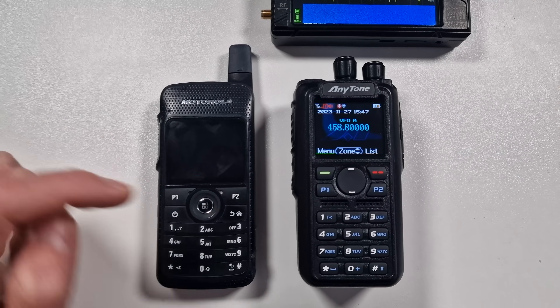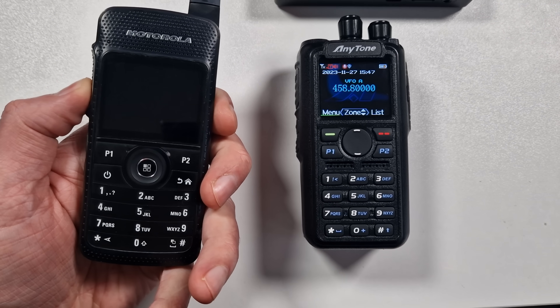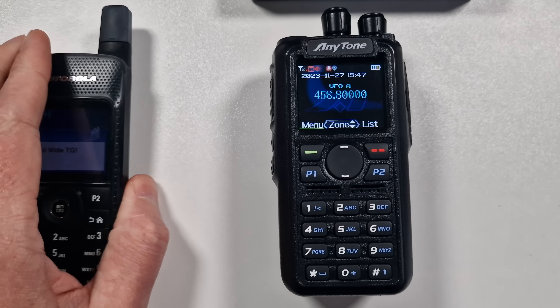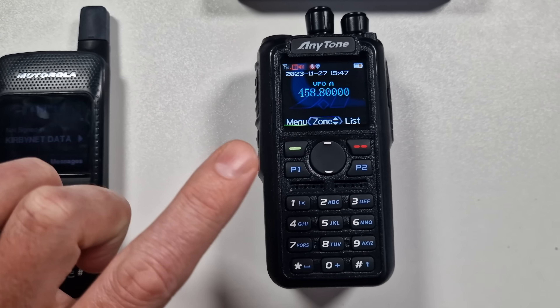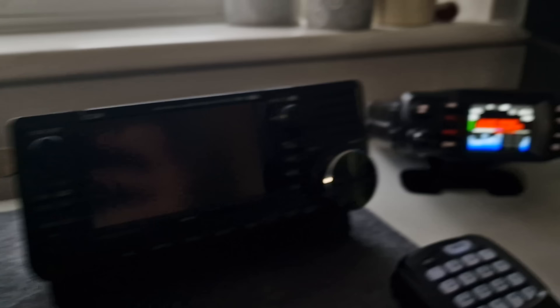You might not be able to listen to the digital one because they could have encryption enabled. Also, if you're using a normal DMR radio to listen to other DMR radios, you have to program a radio — you have to know some information about the setup. But if you have a DMR radio that can operate in promiscuous mode, then you can listen to all traffic on that channel. It will get decoded, but not if it's encrypted. A quick example: we've got an Anytone 878 UV2 acting in promiscuous mode on this channel, and it's just decoding the Motorola. I haven't had to insert any information other than the frequency, which is a PMR licensed frequency in the UK. And the little Icom radio just gets picked up by everything because it's just a simple FM radio.